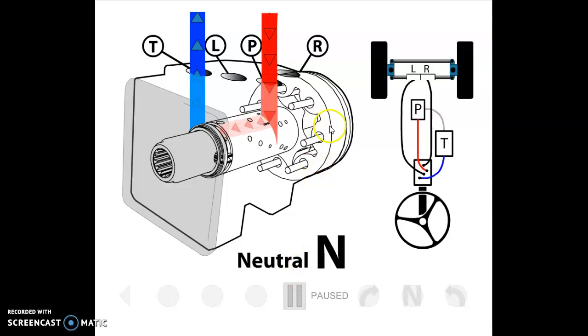This is full hydraulic steering — you won't find this on highway vehicles because a hydraulic cylinder is responsible for steering the wheels. If a hose blows, the system is not as safety-conscious in design as automotive steering. You might think of power steering as having a hydraulic system, but this is not power-assisted steering like you'd find in an automotive vehicle — this is full hydraulic steering.